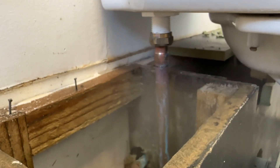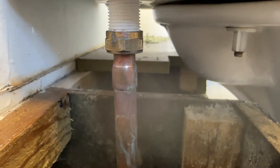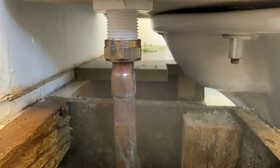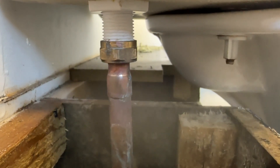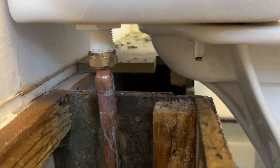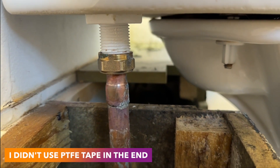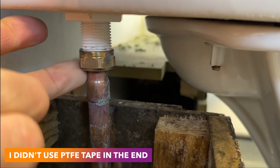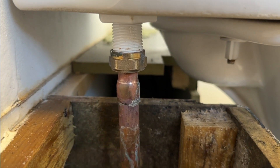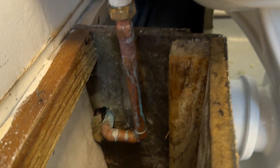There's still a little drip on it. We'll take that apart and try a little bit of tape around it as well. If that doesn't work, I'll get a new inlet valve with a brass tail on it to get a good seal. That all looks good now — I've got two fiber washers in there instead of one, and that seems to have solved it. It's been 10 minutes and it's not weeping or damp at all.